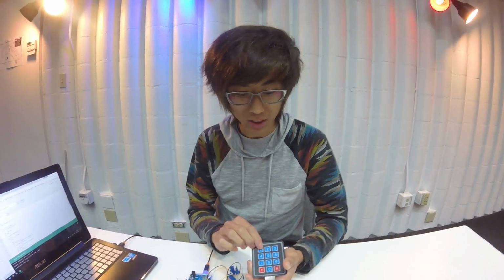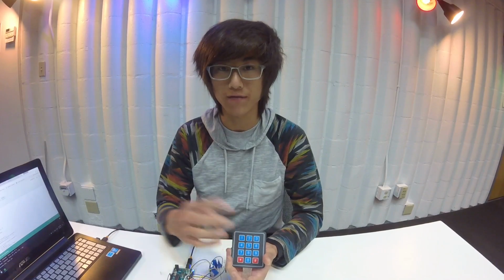And so the code works like this. It starts with the keypad here, and every time I press a key, I run a piece of code that adds whatever key I pressed to the password string, because just like every other digit-based password, I need to type my keys in the right order to get the right password. It also adds a key counter, so that it limits the maximum amount of keys in the password string to 4.